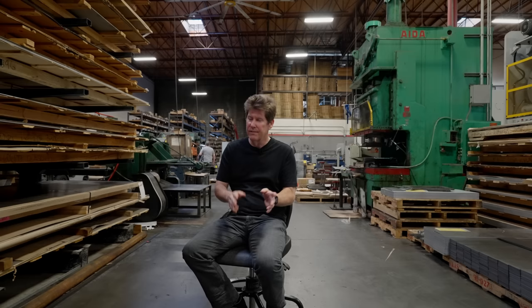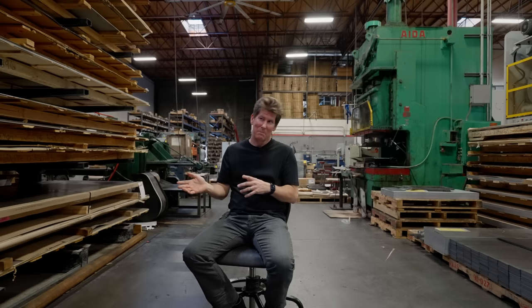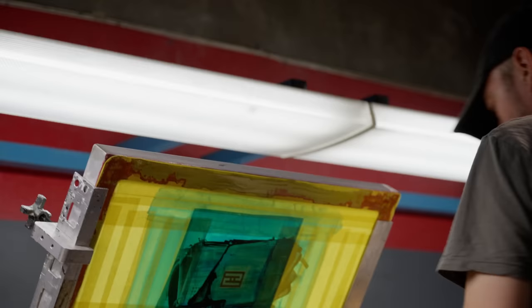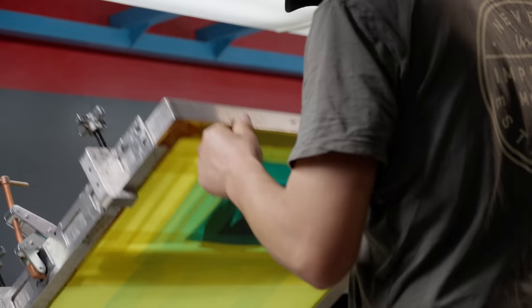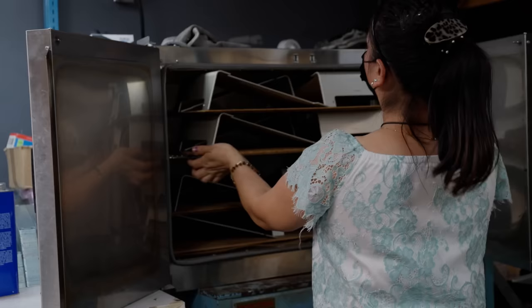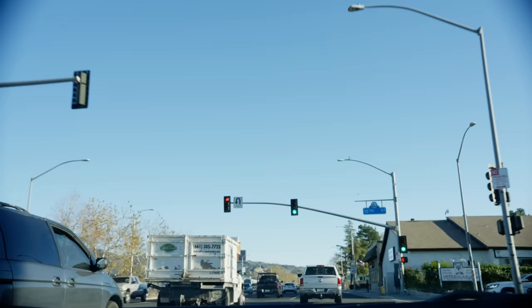The finishing process isn't done at Bloomers, because after the bending is done, the parts go out to either be anodized or powder-coated. We have black powder coat and clear anodized for the silver finish. They sort the products — these are good enough for silver, send these out to silver; these can be powder-coated. Once that's done, it comes back to Bloomers where they silkscreen the parts — our logos and identifying marks, or on the back, all the input-output terminology. It goes in an oven, gets baked, inspected again, and sent out to us. We take the chassis, marry it up with boards, and test it.